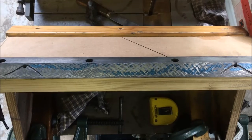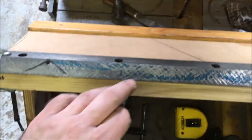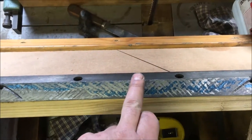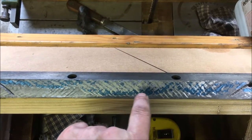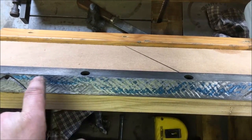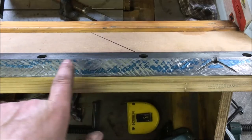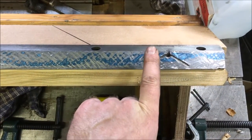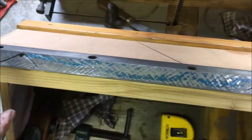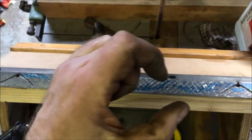This is where we're at after five passes - keeping a tally on the end here. The pivot points have moved from the middle to here, but you can still see where it's picking up here and a bit further out, so I'm slowly getting rid of the lump in the middle. I'm ignoring basically anything on the outside 25% because I think it's rocking a bit as I move it backwards and forwards from one end.